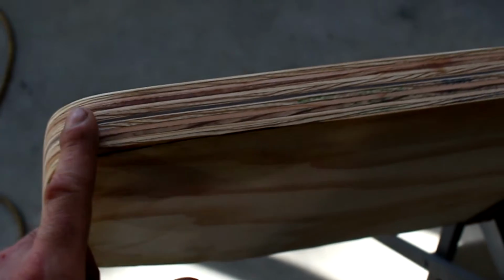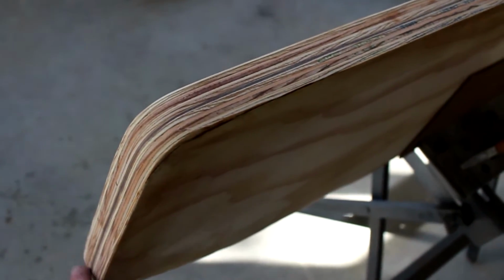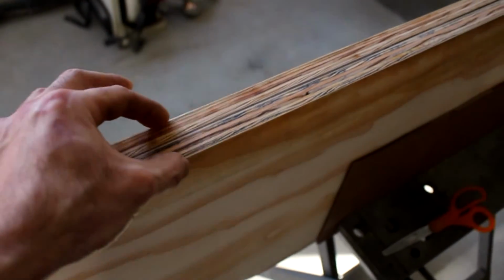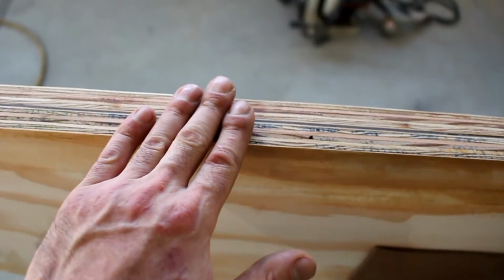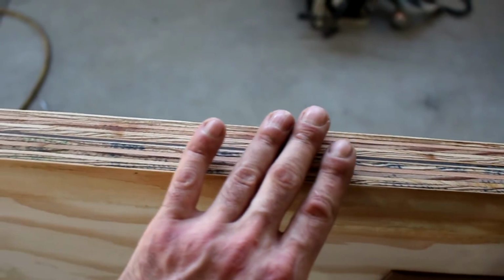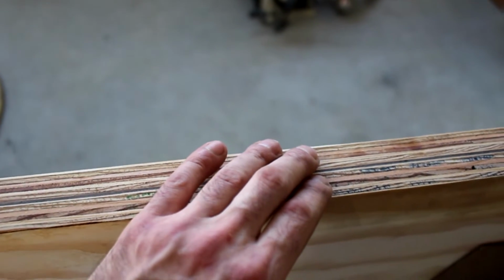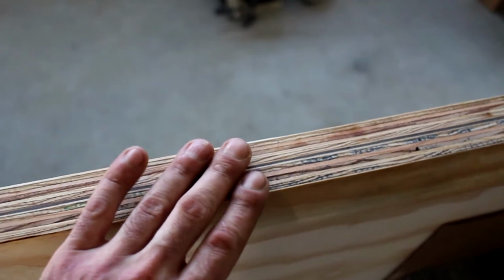So I'm going to seal it with resin, but I've also cut some chop strand to 1.5 inches, and I'm going to lay that up on here before I laminate this transom in and fill whatever void ends up between here and the boat with thickened resin. I think that chop strand is just an extra good layer of protection. Make sure it's sealed. You know, just the resin can eventually peel or crack. If you've got the chop strand matting on there, I feel like it's better.